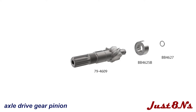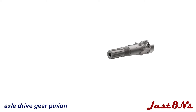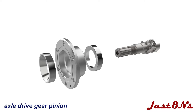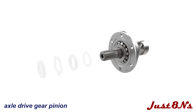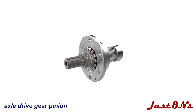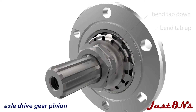Next, build the drive pinion assembly. Slide the pinion pilot bearing on the shaft and install the lock ring. Press in a bearing cup on either side of the pinion drive sleeve, and then place a roller bearing on the pinion shaft followed by the cup and sleeve assembly and another bearing. Follow this with a tabbed thrust washer, nut, lock washer, and second nut. Bend the tabs on the lock washer to secure the nuts — one tab downwards over the inner nut and another tab upwards over the outer nut.